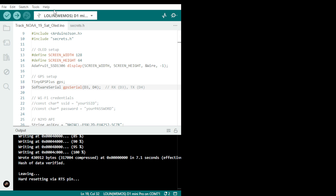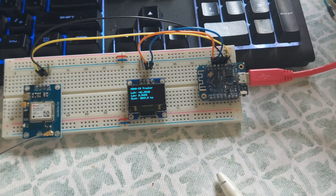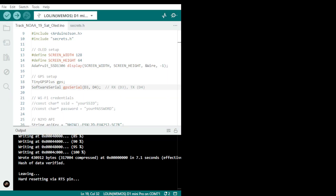It will be placed into D3 as RX and D4 as TX. What you do is swap the two — put D3 and D4 crossed over so that the TX black wire is on D3 and the RX is on D4. You swap them so you don't get confused. I'll always add a file called GPS test — this is very important because a lot of people get confused with this.